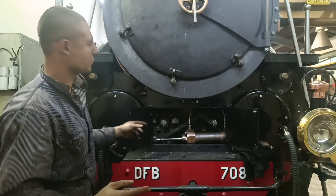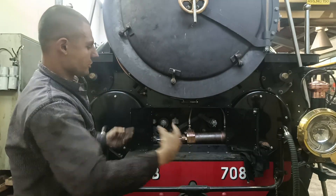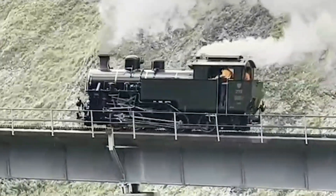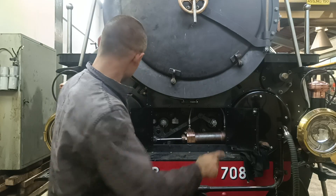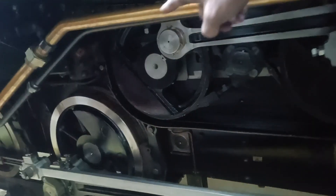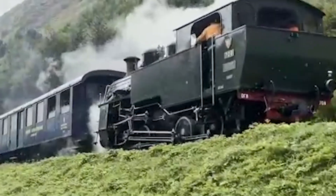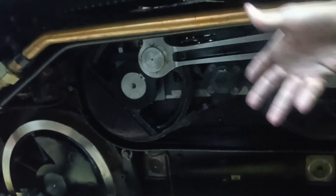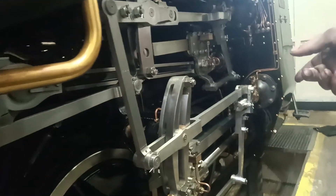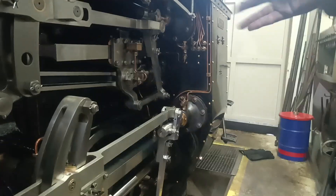The low-pressure cylinders on this engine drive the cranks over that of the main wheels — two crankshafts. The system goes through a gear reduction to the gears underneath that crawl us up the rack. You'll notice the low-pressure cylinders are the same diameter as the high-pressure because of the increased speed we run on the low pressures. This runs at twice the speed of the adhesion drive, so we trade a larger cylinder bore for more strokes per minute. The horsepower is piston area times number of strokes per minute, so the effect is the same.